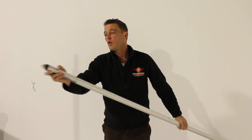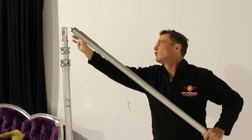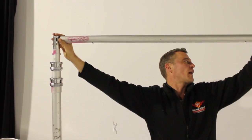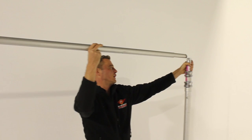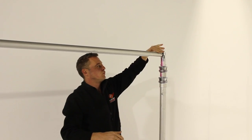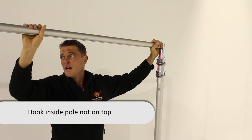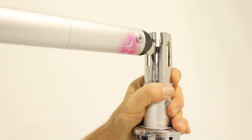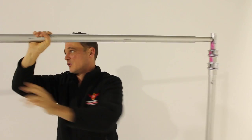These are the hooks and these hooks fit in here. Some places like to put them on top because it means you don't have any lumps poking out, any knobs. However, I find that when it's going up and you're building it, it often slips off. I've seen it happen. So for safety reasons I tend to put it on the inside and we just live with the bump that's here.